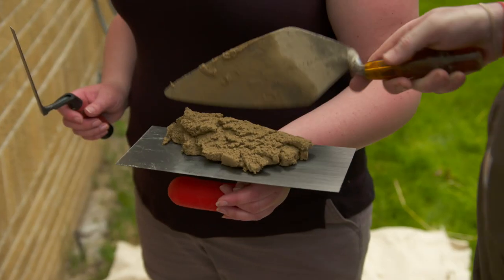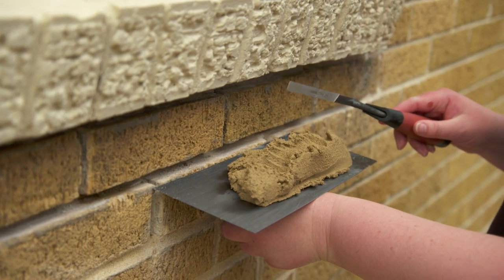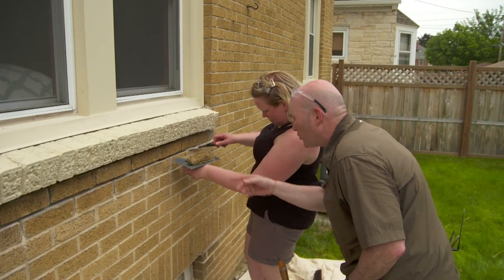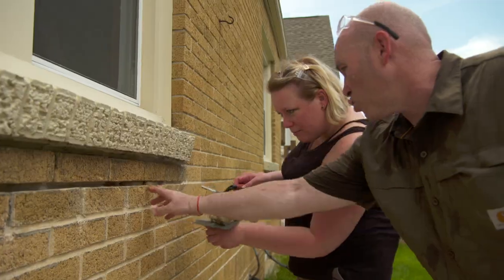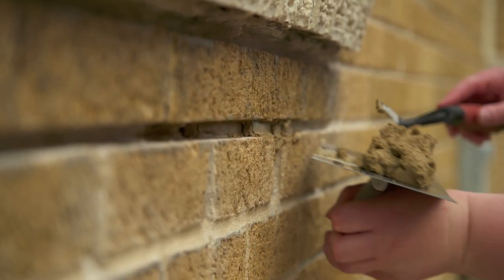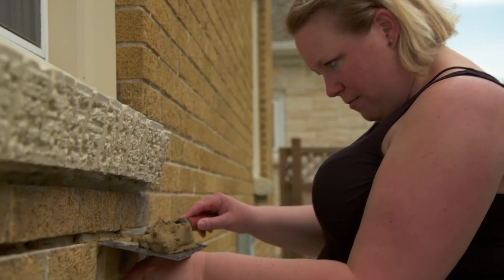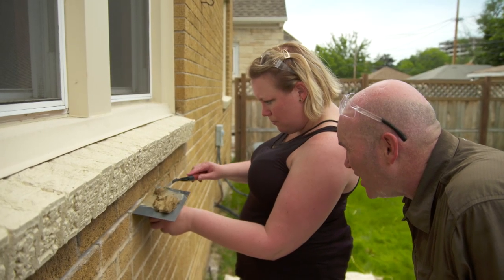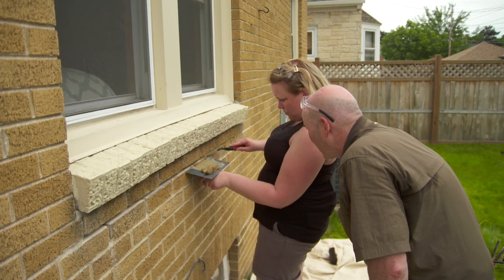Let's try to put some on the wall. I'm going to feed you a little mortar right on top of that finished trowel. You're going to put that right up to the wall. Now take that tuck pointer and push that mortar right into that empty joint — just cut a little piece off and push it in. Make sure you get nice and deep, and continue that action throughout the joint, staying off the edge of the brick. Keep it neat. You can see how the mortar is staying consistent and doesn't look dried out — that's because you wet the brick before. If the brick were completely dry, they'd be sucking water right out of that mortar and that would make the mortar brittle.